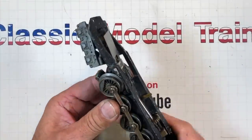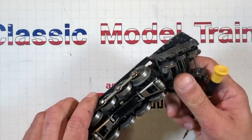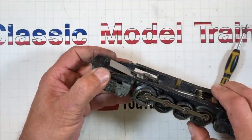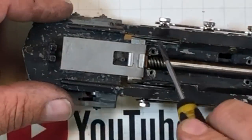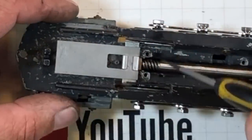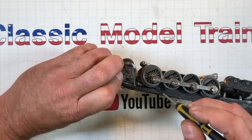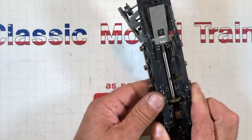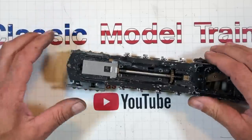What I really wanted to talk about was we got this flapper to flap finally, after I made that spring which is sitting right down in here. On this axle there's a pin, and when that pin rolls around it makes this flapper — this puffer — puff puff puff. So after I made the spring, these little side brackets here were bent, so the thing hung up on the frame and went up and stayed up. I was adjusting these levers, getting this thing completely flat, straight, level, and plumb. And now we've got a functioning flapper for the smoke unit. I spent about three hours working on just that smoke flapper, trying to get it to do what it's supposed to do. I had to go online and figure out what it was — thank God for forums.